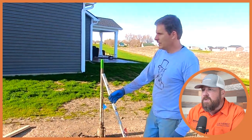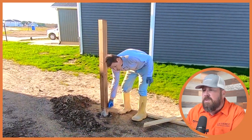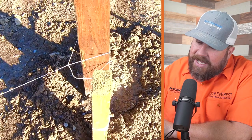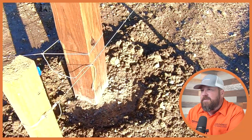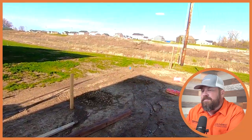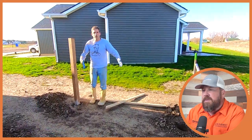The goal is there's a string running from corner post to corner post. It looks like Dan Wheeler and them are very big proponents of string line — we use string line as well. He seems to be running it directly on the post though, so the back of each post in each hole would need to touch that string line. We'll see how this plays out.